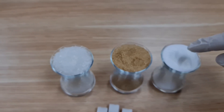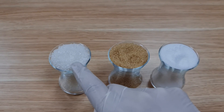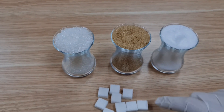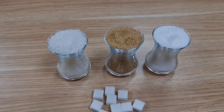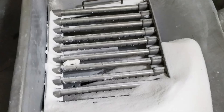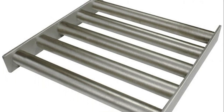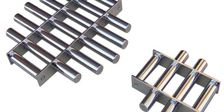This is a granulated sugar produced from sugar cane in Pakistan. If you don't pass these granulated sugars through the crusher, the best cube is made from the Turkish granulated sugar, and the worst-looking cubes will be those made from Pakistani sugar. Their density will not be the same, their corners will not be even, and they will certainly crumble during transport. For these reasons, we strongly recommend using a crusher. In addition, we place magnets in the upper bunker. Thus, we prevent all foreign metal objects that may have entered the granulated sugar from entering the press system and breaking the mold. These magnets capture even small metal particles and prevent them from entering the final product.